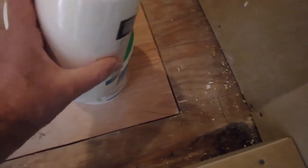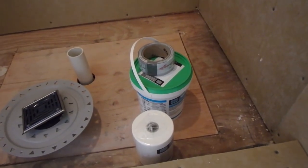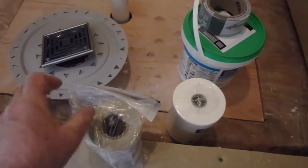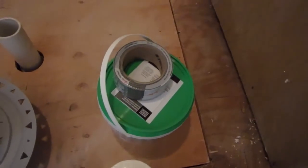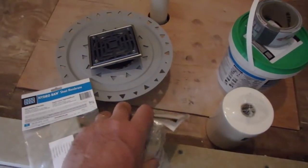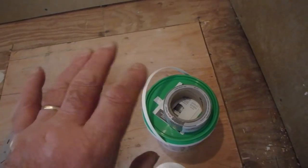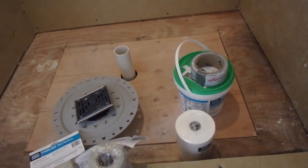Now these options are for a regular shower, when it's not going to be a steam shower. For a steam shower, you have to use different materials. The board's the same, but instead you need to treat the corners with the membrane. It's a kind of band of waterproofing membrane, and they also make inside and outside corners. You would install these with a modified thinset. You also have the option for the floor: you can have their foam pad trays, which you can cut and fit into the floor, or you can do mud.